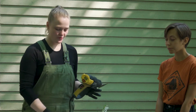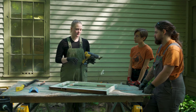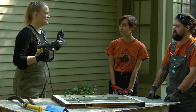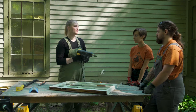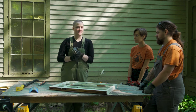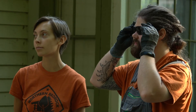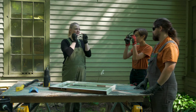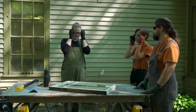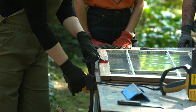My method is to do the paint removal first and then to move on to the glazing removal. I'll have one of my assistants show how to do this efficiently with two people, which means having one person with a heat gun heating the paint while the other person comes in and scrapes the paint away. Personal protective equipment, or PPE, that I tend to use are usually a pair of gloves and a pair of glasses, because sometimes you can kick up little pieces of glazing putty or have dust flying around.